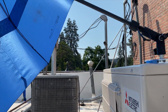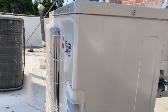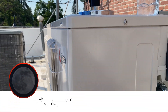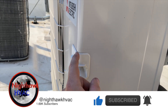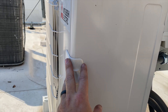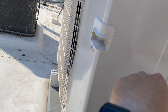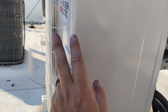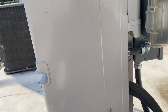We're back on the roof with an umbrella — it's 100 degrees. This unit is throwing a five-flash code on the head unit, which is overcurrent protection or compressor overcurrent protection. Apparently we've had the same issue in the past. The last tech talked to support and they said it was a bad board, so both boards were replaced — a power board and a control board. We're going to open this up and see what's going on. The fact that two boards have been replaced tells me we might actually have a compressor going bad.